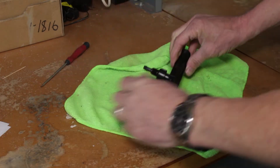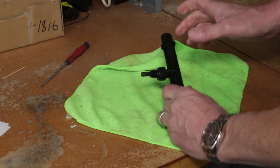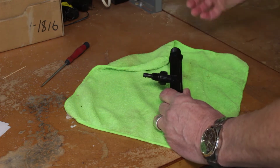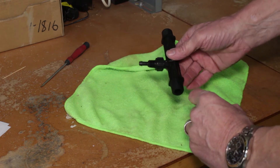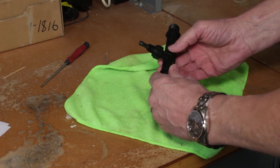I have a separate Mazzei right here so we can have a look at it. The first stage before you start anything: you need to shut off the pump, shut off any valves after this system so water from the whole house doesn't drain back, and you're going to need to drain the pressure tank. Once you've done all that, then you can clean out the Mazzei.